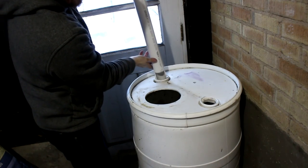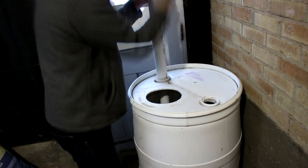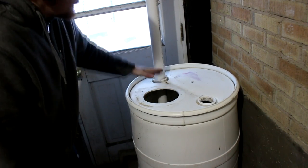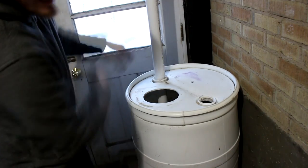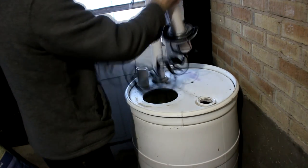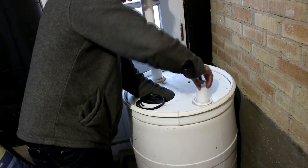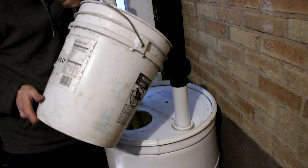This is the fill tube, where I'll put material into the chamber. I'm sticking it up high so I can generate a little bit of pressure - the fluid has to be pushed up a large distance before the thing would blow stuff everywhere. The heater is going to go in right there, and I'll match those up. Now I'll fill this up with cold water to test for leaks.